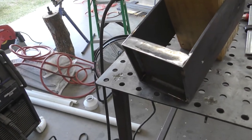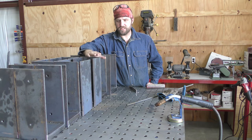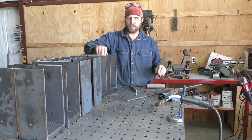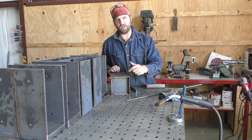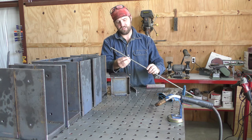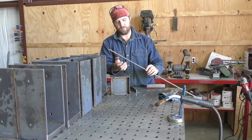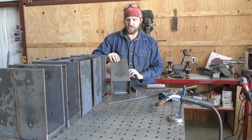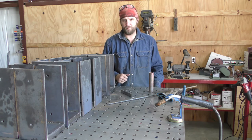Well, one down, lots more to go. I got the twelve brackets done. Next thing to do is to get the rebar and weld it onto them. I'll be doing four pieces of rebar down in all four corners on each base plate — that way I have plenty of surface area to weld. Before I do that though, I actually want to make a loop, a curve, in the rebar, so that it's not just the frictional force along it holding the brackets into the cement — it's actually the curve as well. Because it's going to provide all the tension force while the cement does all the compression force. So to do that, I'll make a little jig real quick using some scrap pieces — just a little curved pipe, angle iron, and a stop. I'll build it up and show you what I'm working with.